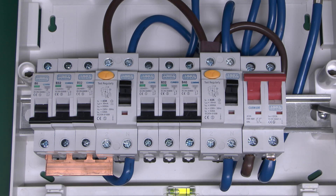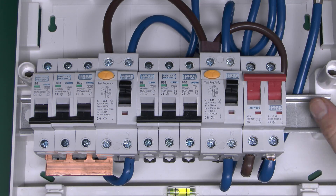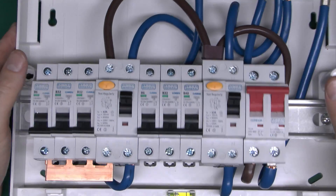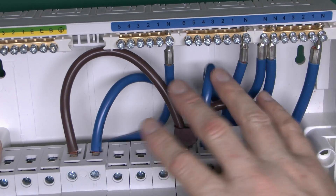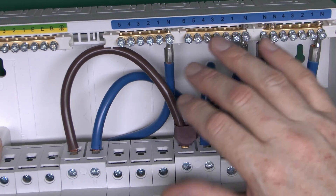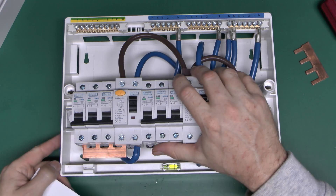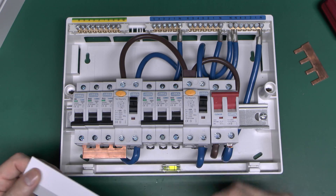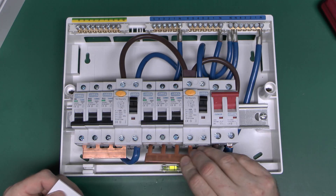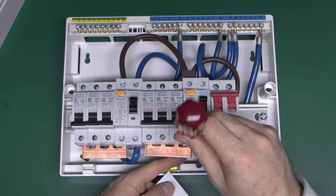On this particular design, and in fact most of them, you can actually move the bar completely just by loosening the screws here and the one at the other end - then this whole assembly can just lift out, which is much easier when it comes to fixing on the wall. You can also disconnect all of these wires here if you would like to take the whole assembly out, but just make sure they go back in the correct places. In a later episode we'll look at actually attaching wires to this sort of thing and how to test them. But once you've put the devices in and your additional copper bar would go in there, it's a question of making sure all of the connections are properly tightened.